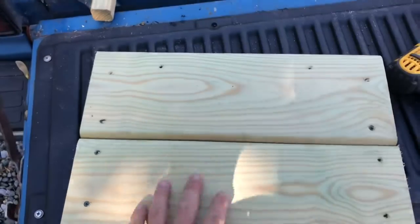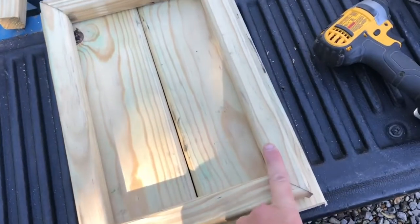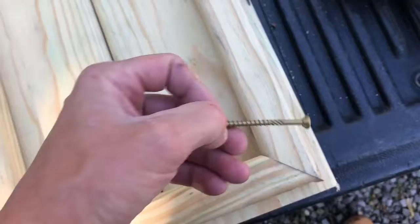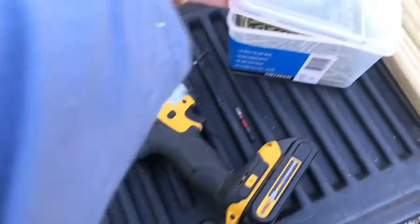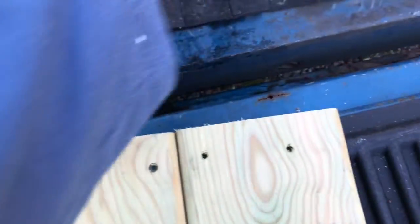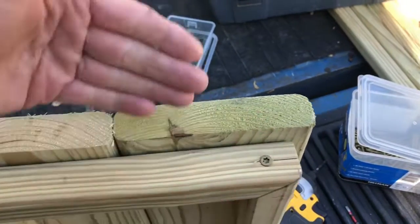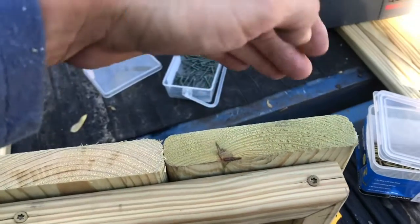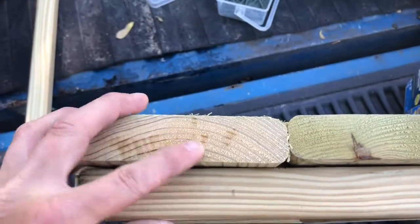Here's our seat — looking pretty good. We use three-inch screws, Torx heads. It goes in like this on both sides, and then I like these deck screws to hold this down like this. See how the grain is running — we got both of those turned down because as this dries — it's really wet right now — it's going to try to curve. We'd rather it curve one way than the other, so we turn that down. That's called crowning — turn that crowning down.